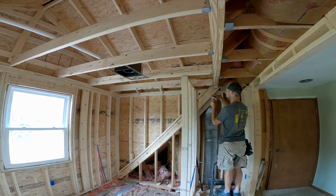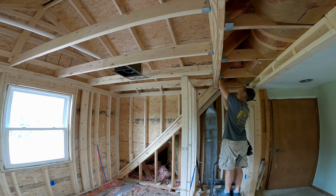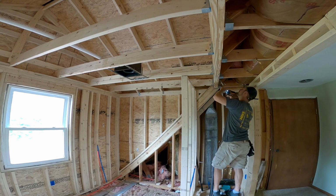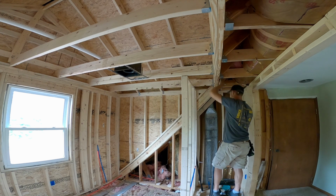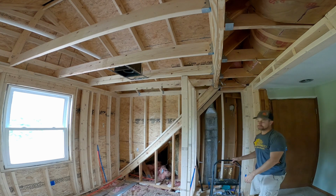I'm going to go to 3000 Kelvin, which it seems like as a family, we like that color temperature the most. I'm going to go ahead and mount these maybe about 1/2 inch up off of where the sheetrock is going to mount. Two quick screws. Good to go. Boxes do come with wire nuts in them and all that good stuff.